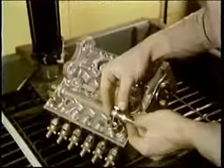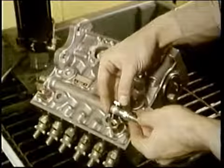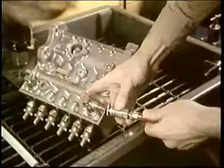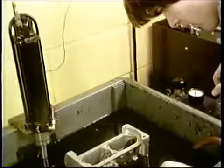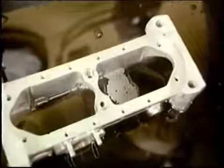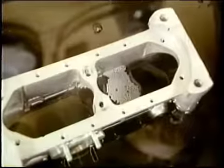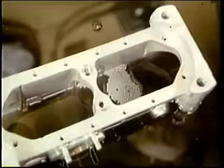Connect your air hose fitting to the fuel inlet after plugging the fuel outlet. When the connection is complete to the fuel gallery, you're ready to lower the pump and apply the air pressure, about 5 bar, 75 psi. If you see leakage like this, check your O-rings, but a very small stream of air bubbles directly from the plungers is normal. That completes your leak test.